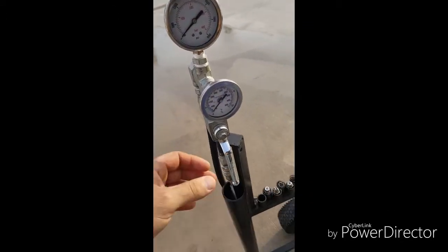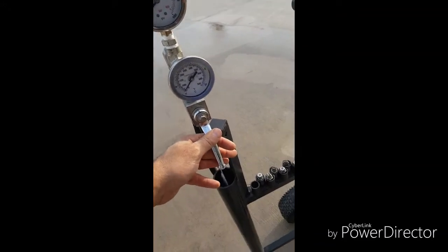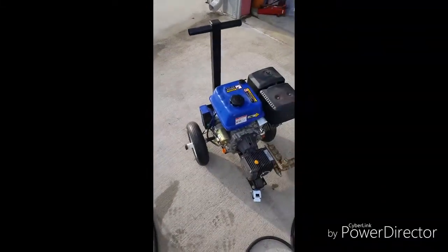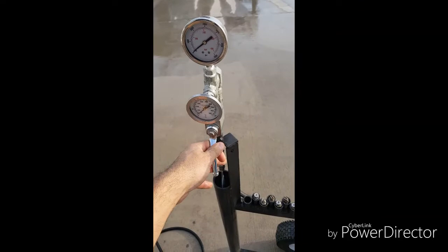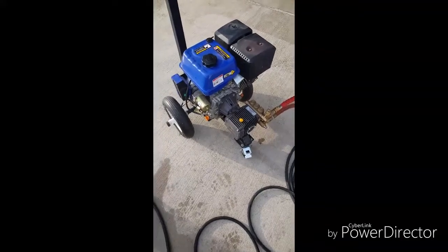Alright, so we're getting 3,800 PSI, which is actually pretty good. Generally a Honda GX390 only gets 3,600 PSI at 4 gallons per minute, so this will definitely be good enough to clean our equipment off around the shop. We could also use it for household-related cleaning items like cleaning driveways and things like that. A lot of guys have machines pretty similar to this with a 4,000 at 4 pump, so I thought y'all would enjoy this.